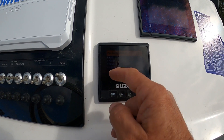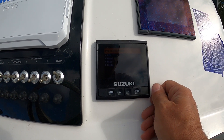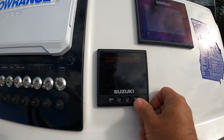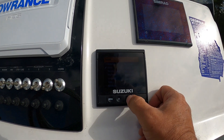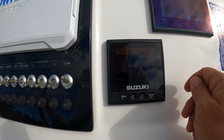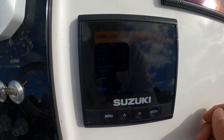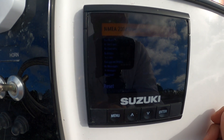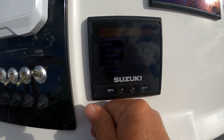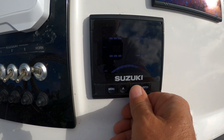Under sources, everything's there — GPS, vessel, sonar, and engine. That's a good sign — sonar and engine didn't show up last time. The network device list shows the C10 is there. In network diagnostics, last time the bus was off but here it says the bus is on. Bus load is zero percent right now, which isn't great — it should have some kind of load — but the bus is on. And yet I've got nothing; this meter is not reading it.